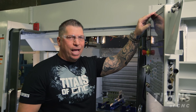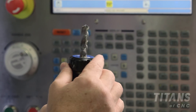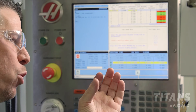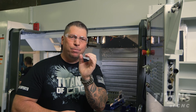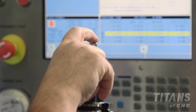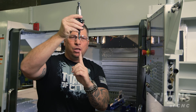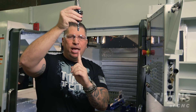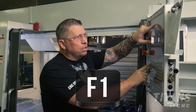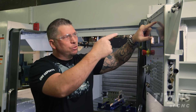Next I'm going to go over to the diameter. We just did a three-inch shell mill, but now we're doing a half-inch drill. Probing a half-inch drill is a little different. The shell mill had a wide diameter and when probing it offset itself half the diameter so the tip of the insert could touch the probe. In this case it's a drill that has a point — the probe and the drill are going to be center-lined together. The drill is going to come down, touch the probe, and lift up. On the diameter callout I'm going to put .5, hit F1, which instantly populates the dimension — .5. I double checked it, looks great.